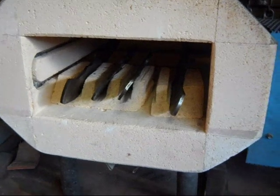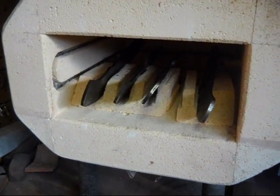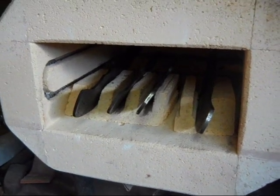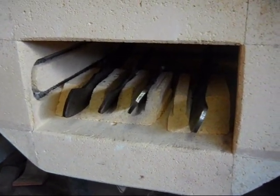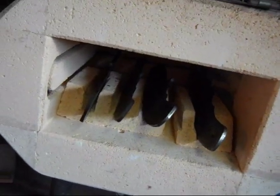The next thing I'm going to do is temper the blades. Heating to 1525 degrees and then cooling quickly — or quenching — actually hardens it, but now they're brittle. So I want to take some of that brittleness out of the blades, and that's called tempering.